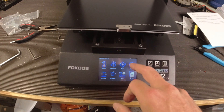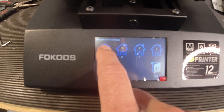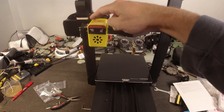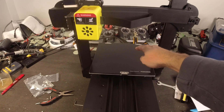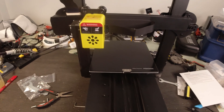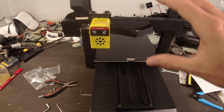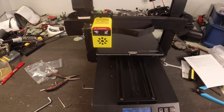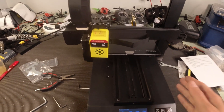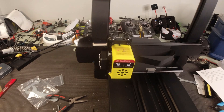The first thing I'd do is go to home. Go to the tools screen right here, then go to home and you can just home everything. That should get the positioning of everything based on the sensor. It went over to the left here and based on a sensor, this went back all the way — there's a pressure switch in the back that with one screw hits, you can actually hear it click. That lets it know it's all the way in the back. Then the gantry comes down and a sensor detects when it's all the way down to home the X, Y, and Z positions. Listen how quiet the stepper motors are — all you hear is the fan in the unit. This fan is supposedly fairly loud, but the motors are definitely quiet on this thing.